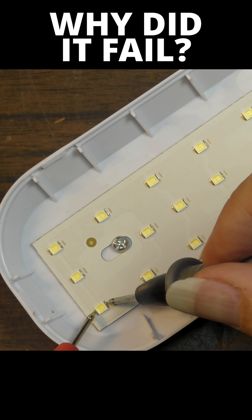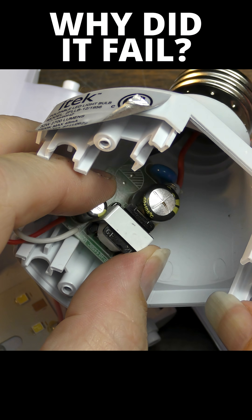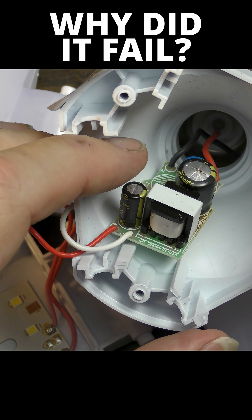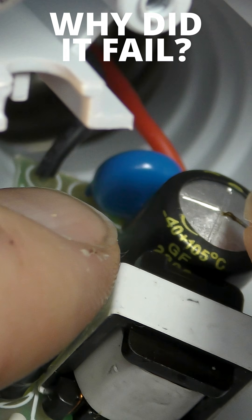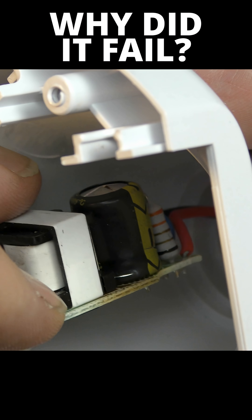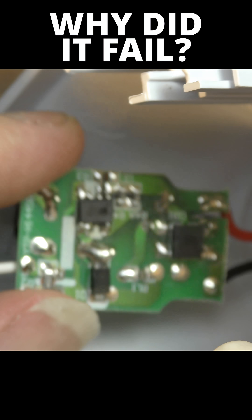And the final three? Wow. Okay, so what I'm noticing right off is that we have a bad capacitor. There are some score lines and those are split, actually even in the middle right there — so this is a blown capacitor.